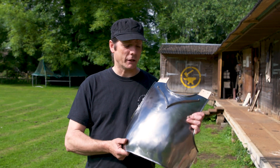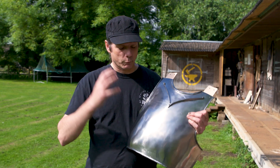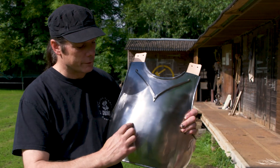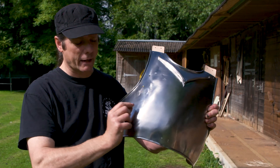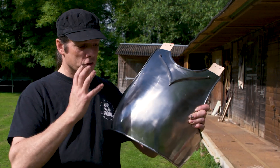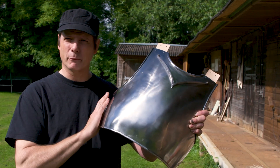The original is dated at 1390, so we're right on key, ready for the build-up to Agincourt. The way that it's constructed is absolutely astounding. Just like the original, the central section here on the breastplate is thicker — up to two and a half millimetres thick — and it tapers down to one and a half millimetres at the side where you need less thickness. Just like a modern tank, if an armour plate is square it needs to be thicker and stronger. Where it's angled, you can get away with losing that weight.